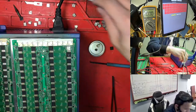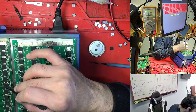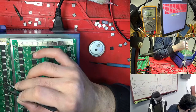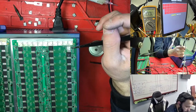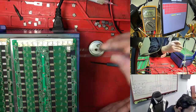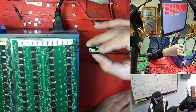Before, I worked with the S19AL, and the S19AL is similar to this, because this one is also an aluminium Hashboard. But with the S19AL, what I noticed is that anytime the pin is missing here, you don't have enough soldering, so it's not working. But actually this one has everything, the pin is good, everything is nice, but I don't know, it's not working. So this one we bring back here to see. The two chips I changed both with another one, so we see again.